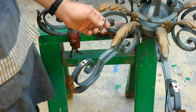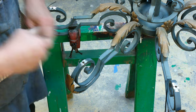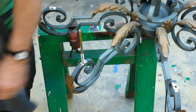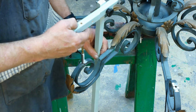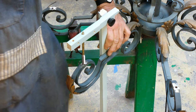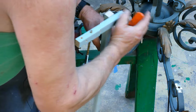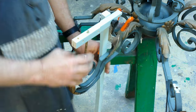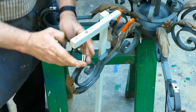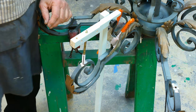As soon as I put the torch to this thing, it's just going to fall off. So, start off with a piece of brass rod to hold it straight. I've come across this problem enough times that I've actually made a fixture for holding the rod in place, and that way I can eyeball it to get it square in both directions. Two quick tacks and I'll move on to the next one.